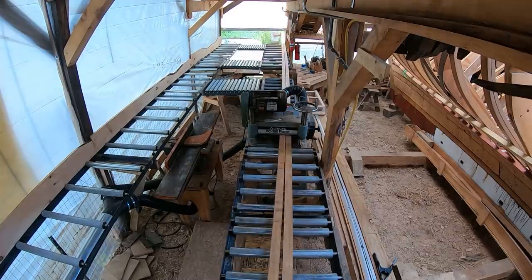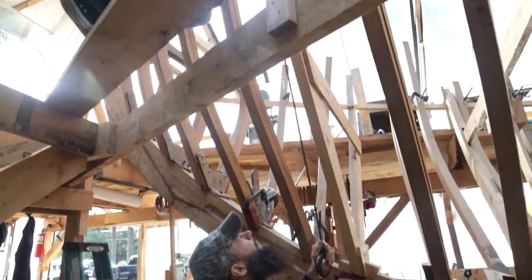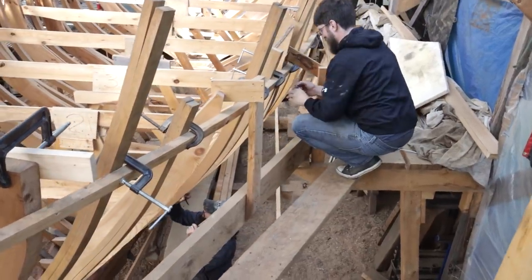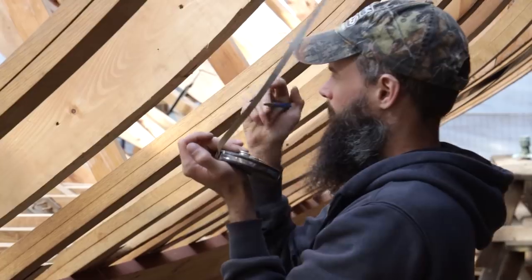Before we sprung the batten onto the boat, we needed to line off again. Back when we put on the garboard, we lined off from the rabbet, but going forward, we were going to need to line off from the shear. We'll get deeper into why we're doing this now in the next video.